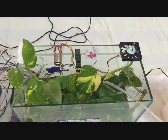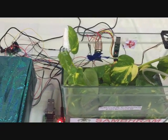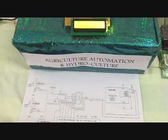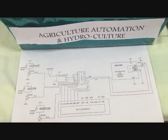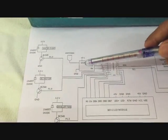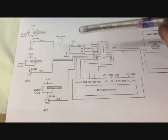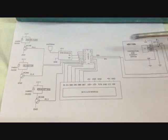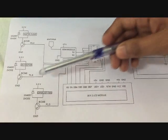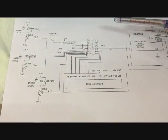For use of the DC motor, water pump and the exhaust fan with a microcontroller, it is required to use a protection circuit consisting of an NPN transistor, current limiter resistor and a diode as shown in the schematic. The DC motor, water pump and the exhaust fan are actuated when a control signal from the controller occurs at the base of the transistor. The diode prevents reverse current which could damage the controller if not used.